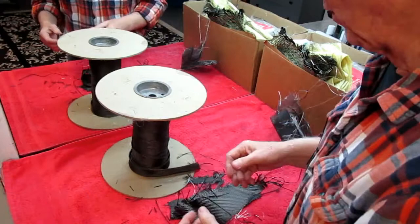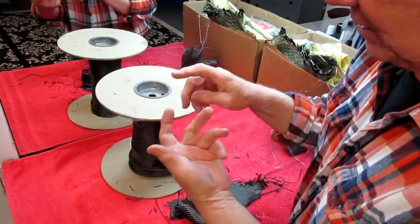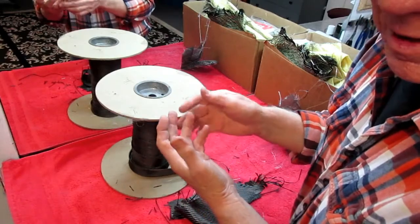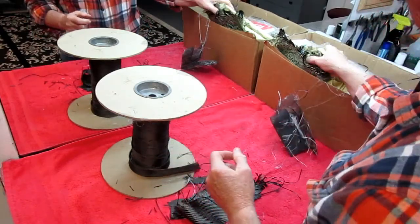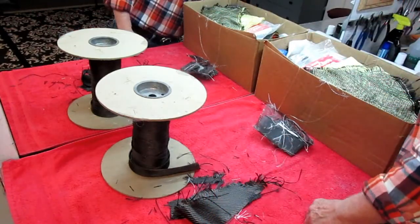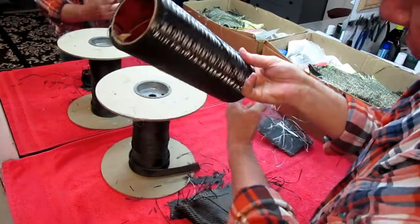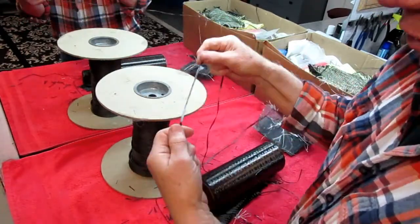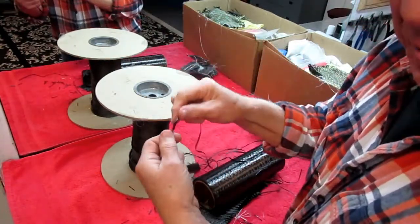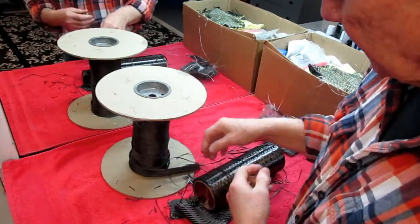So here's my point. You could do this part. The 105 resin is easy to use. It's really not as toxic as EPONs or any of the Huntsmans or anything. But what this allows you to do, let me just show another thing. Because I'm trying to show, this is how carbon fiber is sold too. It's called tow. And what you can do with tow is, you're looking to reinforce a part, you can wrap it like that, put resin in it. You can make little things.